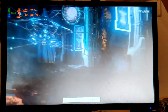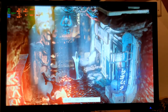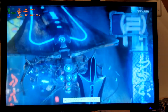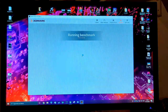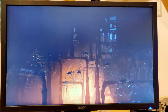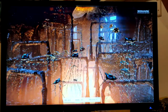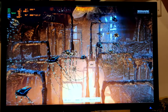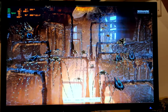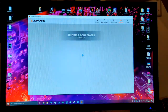and I have to get good enough results from my way of doing it. Because you saw in the beginning, I don't have a radiator submerged down there, because I did that once and the radiator rusted, and I would like to not have that happen again. So I thought I'm just gonna put the tubes into water directly. The only problem is, I have heard that that actually performs worse thermally, which I believe is because you should have your inlet at the bottom of the bucket where the cold water is, and then an outlet on the top where the warmer water is. And I think people weren't accounting for that, which I'm also not accounting for right now.